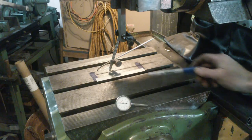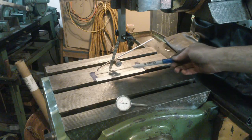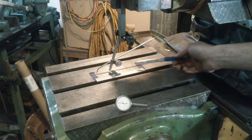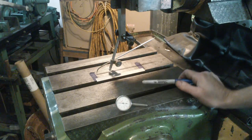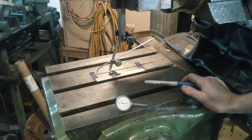After confirming six inches of stroke, we tilted the table and put our Starrett 196 indicator in there. We adjusted the table until we had 125 thousandths difference between the stop and start points. I'm pretty happy that'll give us the taper we need for the gib. There's probably better ways to do this, but I don't have a six-inch plunger indicator, so this is the best way I could come up with.